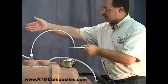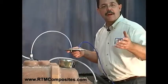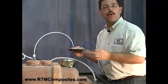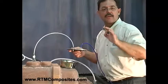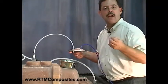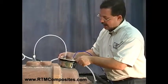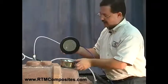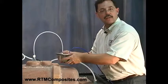Many of our clients, especially using the Infuser PRG, have a biggest pride factor when you visit their facility — they'll show you they're holding their resin usage within 10 grams or 5 grams or the size of a quarter into a catch pot, showing just how accurately they can repeat their process. We're going to bring the lid together because this lid has an elastomer seal sealing on this flange, and we'll start the vacuum.